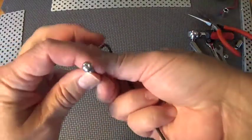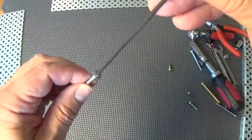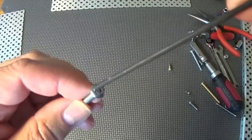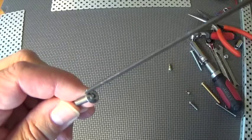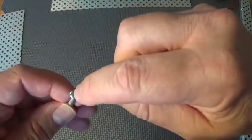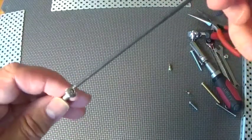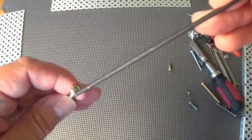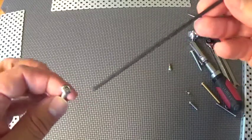One thing you want to be careful about when using your hex wrench or Allen wrench — make sure it's well seated inside the little hex-shaped indentation. If you're not fully engaged in there and you're trying to wrench it really hard, you can strip that or start to round it out. It can also round out the end of the tool. After a while, you can end up stripping out that screw, making it hard to get out of your machine, and it can also damage the tool over time.